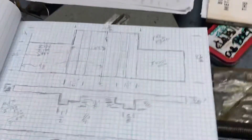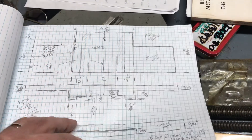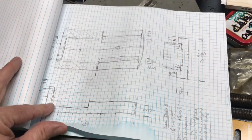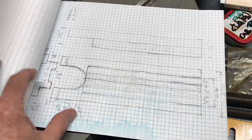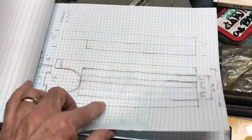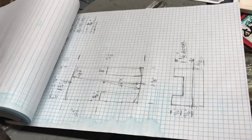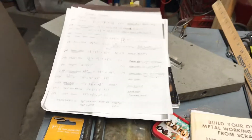I've taken some of the drawings from the book and put them out on grid paper, and made notes about the size of the actual material I have and what my cutting path would be for machining them. Here's the column front — I'll probably start with this piece — and this is the cross slide. I catalogued the sizes of the parts and made a list from the book of the actual casting sizes, then compared them to the blocks I have. I'd have probably 90 to 95 percent of what I need from the large aluminum stock.